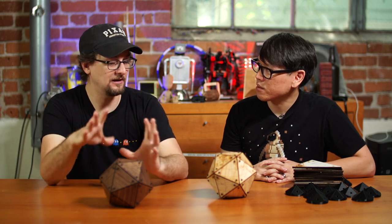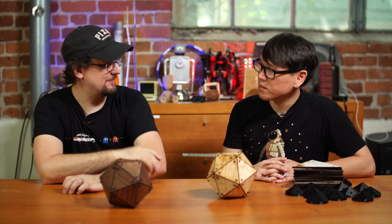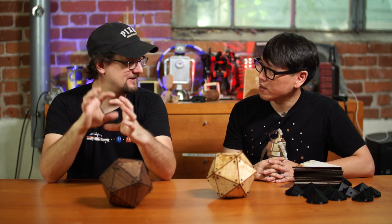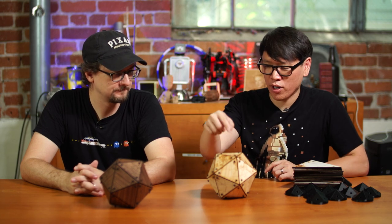So I kind of correlate them to the raster etching is kind of like using a big fat marker to do it, and it's quick for if you need to engrave a lot, it is the fastest option. Yeah. The vector etching is more like doing it with a fine tip. If it has a large area to do, it'll take forever. And that vector etching worked best when the line thickness was 0.001 as well. So it was drawing those lines.